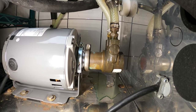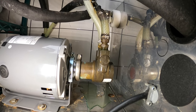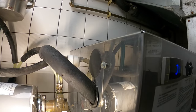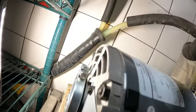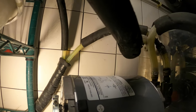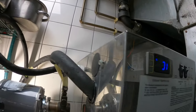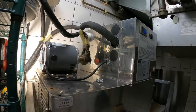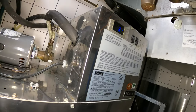It was also recommended by the manufacturer that when you change the motor you change the pump as well. So we're going to change the pump, fix this leaking hose — I don't want to lose the concentration — they should be good for the weekend. Pump, fix the leak, check levels and glycol for the next visit. Those lines are condensating so we know it's pretty warm in here and those lines are cold enough to actually condensate, so we should be good. We're going to wrap this one up — change the pump and we're good to go. If anyone found this video interesting or helpful please drop a like, comment, and subscribe as I come up with new videos every week. Catch you all next time, bye.